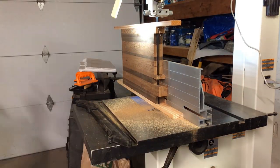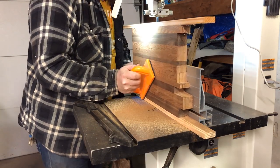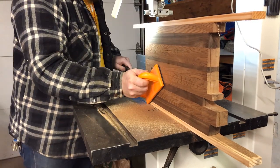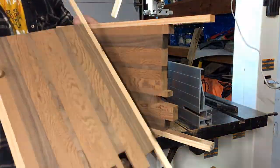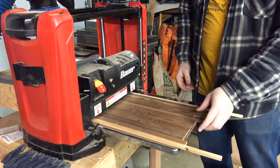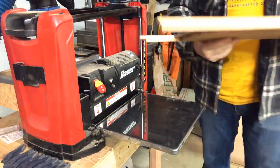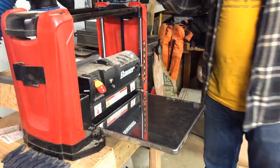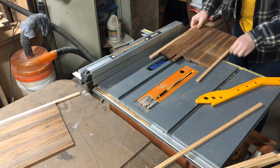And here's the fun part: resawing — slicing off in essence almost a veneer. These are about three-eighths of an inch thick because the clipboards are going to be planed and sanded down to a quarter of an inch. Because I put the runners on before I resawed the pieces, the runners are still glued, allowing me to throw it through the planer and have those runners eat up all the snipe. Here I'm cutting the runners off.